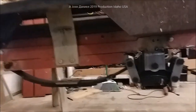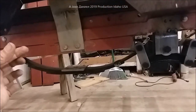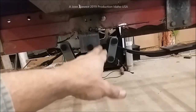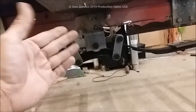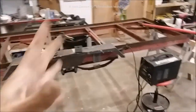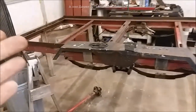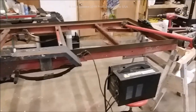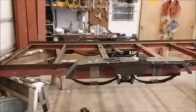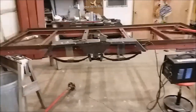This one set of springs works perfect for that. If you just wanted to take some inch-and-a-half by two-inch angle or some C-channel and run it down the whole length, you can - just put some kind of a mount to mount the center and you don't need all the hardware. That does a little light-duty, roughly 3,500 pound max trailer that you can haul behind a Toyota or in my case my little Escort station wagon. It's about 550 pounds - I know that because I lifted this thing up and sat it on sawhorses.